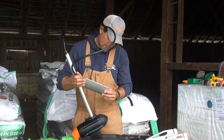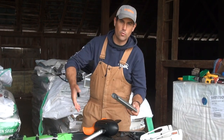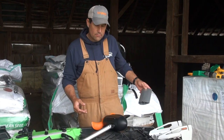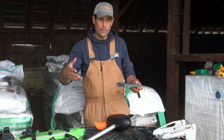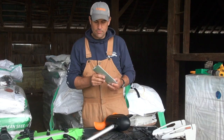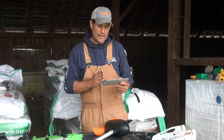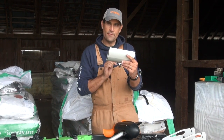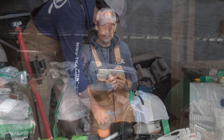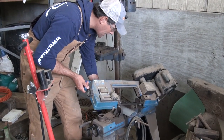We're just going to take the profile over, and let me say this much. If you're fishing salt water or lakes or a place where you want it deep enough so that when it's pitching and rolling over wake or wind-driven waves, you want it deep. But this specific application Bill's going to be using, fishing the river, you really want it as shallow as possible. And this is limiting that, so we're going to chop about 2 inches off so that he's able to keep going super shallow. All right, I got it in there, chocked.